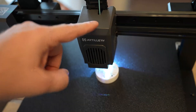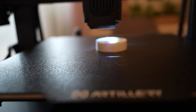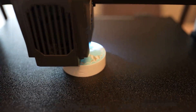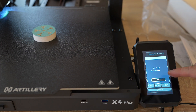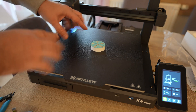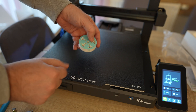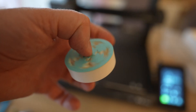The problem is the filament change should happen at the corner, not above the object, but we'll see what happens. There will probably be some oozing lines, but I'll continue immediately with printing. It is nice to see the filament runout sensor works correctly, but this print was 2.5 hours — which is too slow. Fantastic feature: when it cools down it's completely silent. First attempt — perfect. The oozing from the filament change is visible, but actually it looks very interesting.